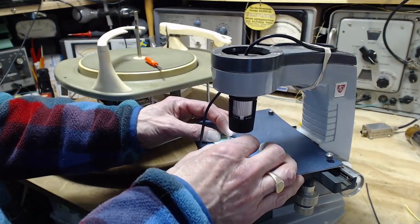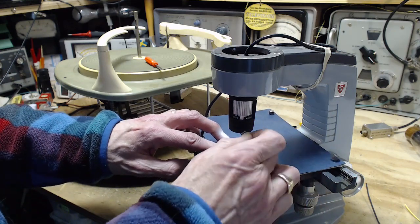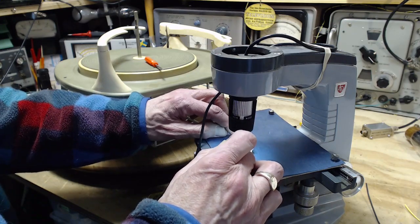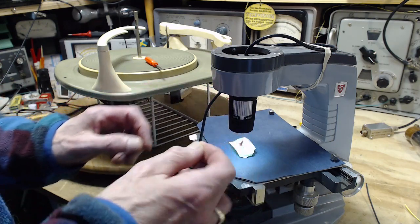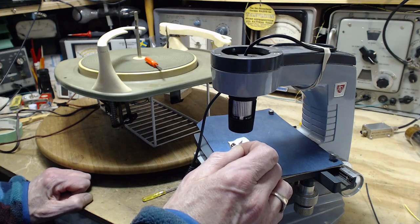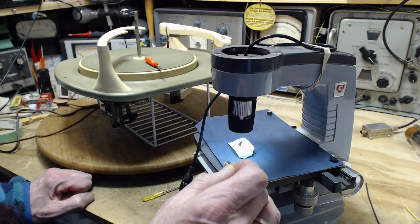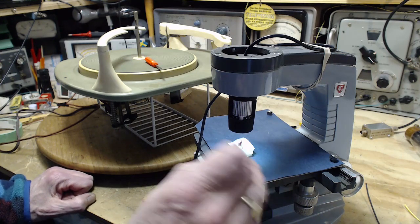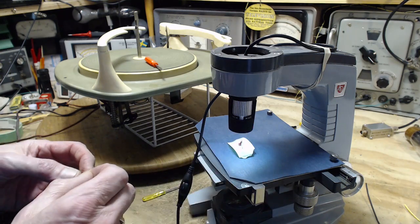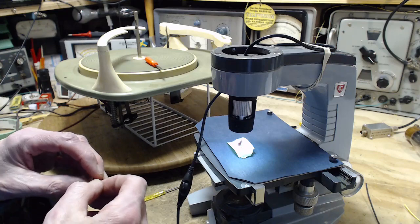Huge difference. So a needle like this, a diamond needle, is good for about 1,000 LP sides. So that's 20 minutes of music. You play the whole record, it's 40 minutes. So you're going to do 1,000 sides. That would be like 300 hours. Or you can think of it this way. You play a record a day. That's 350 records a year. So if you play a record a day, both sides, you can play records for about a year and a half before you should change the needle. You can imagine most of these really old vintage needles have a lot more mileage on them than that.